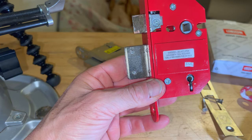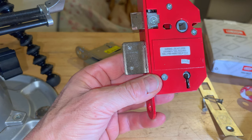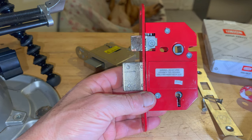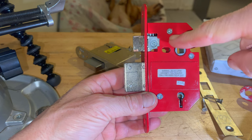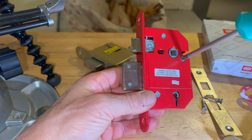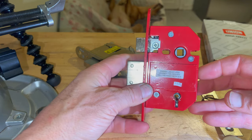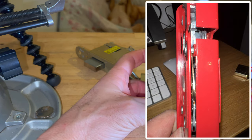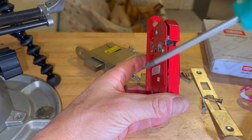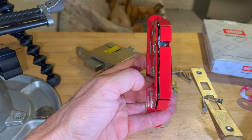So if you ever look through the keyhole and see this misalignment of the curtain, and you're getting some particularly funny behaviour on the key, one thing you should always do when fitting a mortise lock to a door — especially a Fortress — is check that the cap screws are tight. Because if you don't, as time goes by — and that's what's happened here — the screws come loose and the case or cap comes apart. Obviously the curtain and the lever pack are then all out of alignment and you're unable to operate the lock properly.